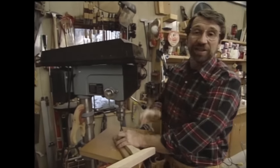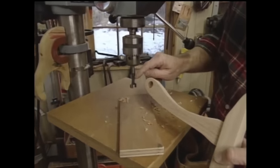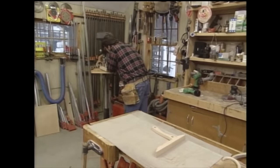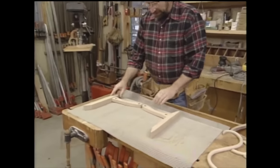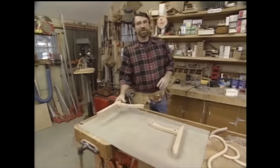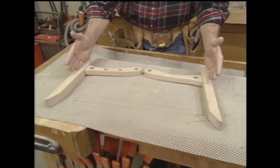Good morning. Before I can do any assembly today, I have to drill some holes for the dowels that will connect each end of our hat rack. I'm starting with a three-quarter inch Forstner bit — I have to drill two holes in the horizontal piece, one at the end and one closest to the vertical piece. Now the remaining dowels will be five-eighths of an inch in diameter, so I'll change my bit and drill those. About the only thing that can go wrong here is drilling the holes on the wrong side of the bracket, so the best way to avoid that is to lay them out and make mirror images.